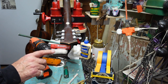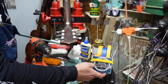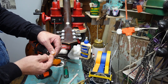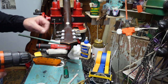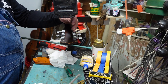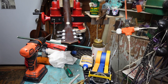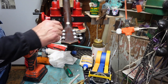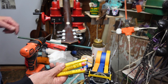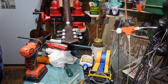Everything is lined up. I have the right bit — it doesn't need to be too big, and you always want to drill pilot holes so you don't crack it. Take a little piece of tape on the bit as a depth guide; when that tape flapper hits the top of the screw retainer, I know I'm in deep enough. If you don't care for the Swiss cheese mess and want to hide it, you can use furniture scuff markers — golden oak, dark walnut, red oak. I like battle scars.